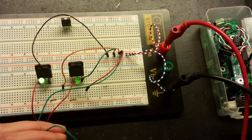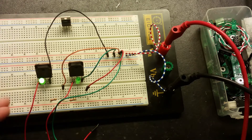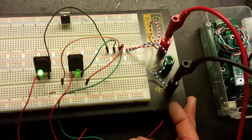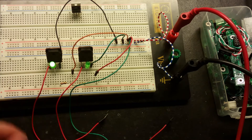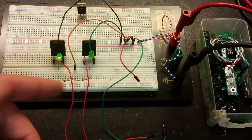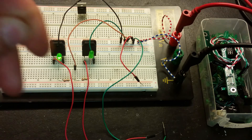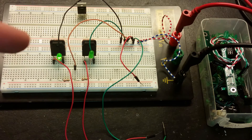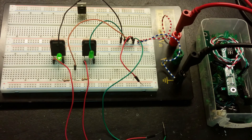This one is blown so I should try to find a replacement. Maybe I can use other IGBTs as long as they have the same characteristics - gate capacitance, threshold voltages on the gate. I'll look around for another pair of IGBTs to solder into that. This video is getting a bit long so I'll put the rest in Part 2, where I'll change these transistors and test it to see if it survives or if there's anything more wrong with the stove. Hope you found this video interesting - thanks for watching, Part 2 will come soon.